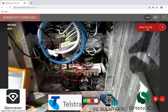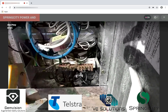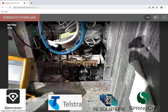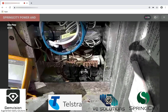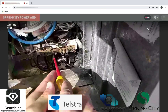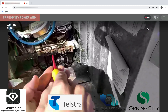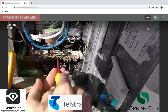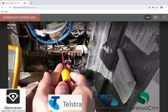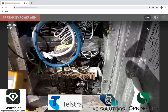Yep, perfect. We're back in live mode. If you just do a quick tightness check on that wire on both screws and let me know what you find. That one's tight — oh, this one's loose. Right, so that one was a bit loose. That might have been the problem because there was a loose wire there.